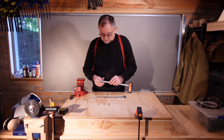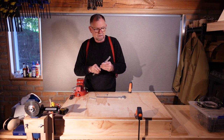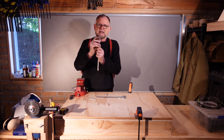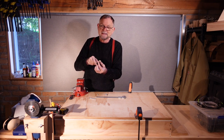And finally, we are going to bend these two flaps over at each end to lock in the threaded rod. And then finally, grind off the edges of the end nut, leaving a square profile at the neck end of the truss rod.